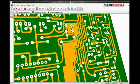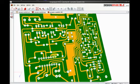It's called a diode pump, so it basically goes through 1N914 diodes, and they can't handle a lot of current, about 200 milliamps, so you can't expect to get a lot out of the output. But it's there because I need it right now, and I haven't got the Chinese thing which I've ordered, and I need a way of testing it and setting it up, so that's what that circuit on this side of the board is for.